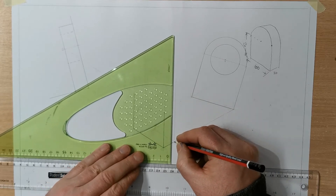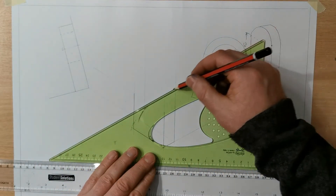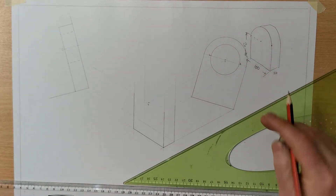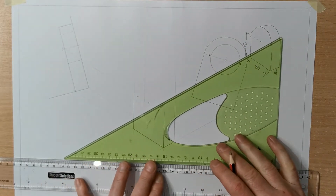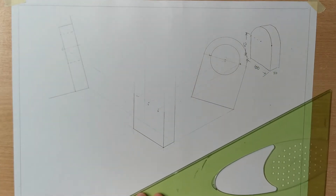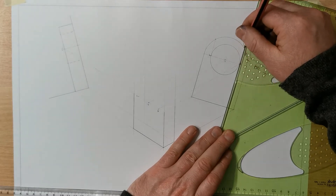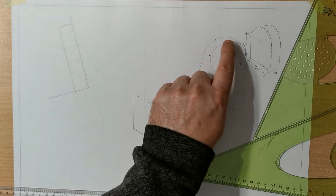So I'll just heavy that in. Straight, straight, straight. So the easy bits are done. I'm also going to bring down the center of the circle. The smart thing to do here is I'm going to mark the left and the right of the hole going through that — and I'll show you why in a second. There's the left, there's the right hand side of the hole going through it. I'm going to use those points now because straight above the left is this point and straight above the right is that point and straight above the center is that. So that's three points on the outside curve.